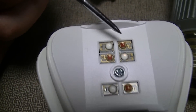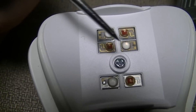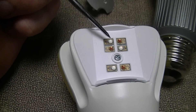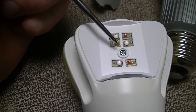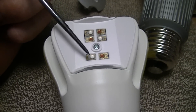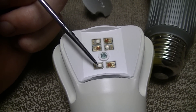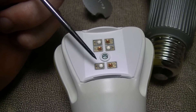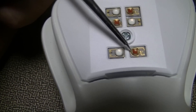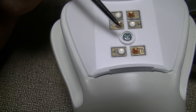It has two different types of LEDs in it. The white ones — these are Luxeon Rebel LEDs by the way — are blue LEDs using an indium gallium nitride die. And the red ones are aluminum indium gallium phosphide die LEDs.